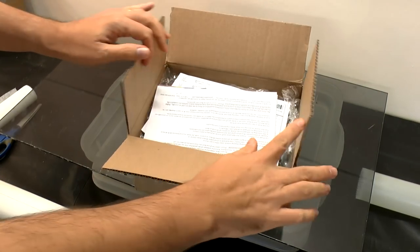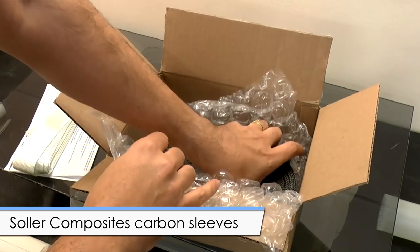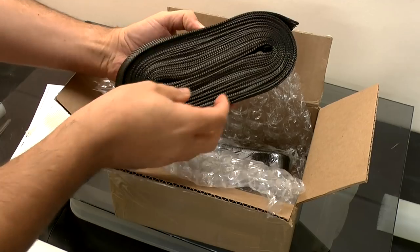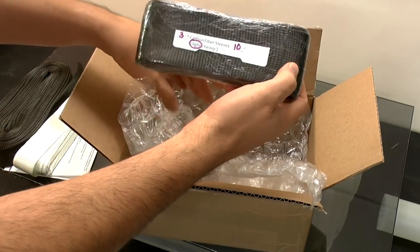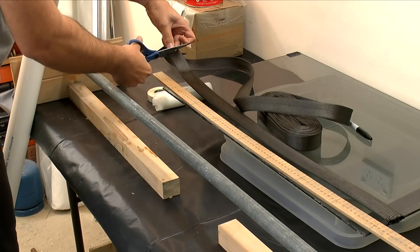These pressure chambers are made from carbon fiber. We buy our carbon sleeves from Solid Composites in the US because they've got a good selection of sizes and weights at reasonable prices. We make the pressure chambers in two stages: first we make an inner liner out of several pieces and glue them together, and this then gets reinforced with another sleeve. We cut the sleeve to length first.